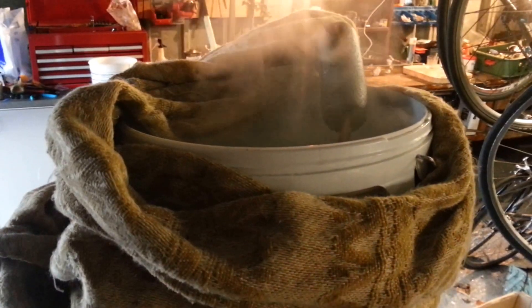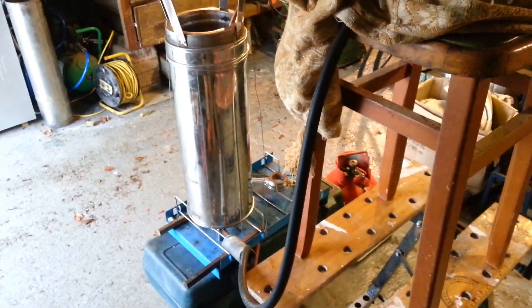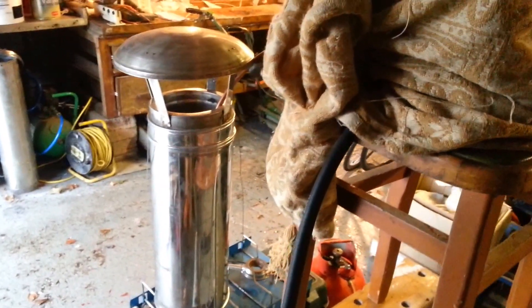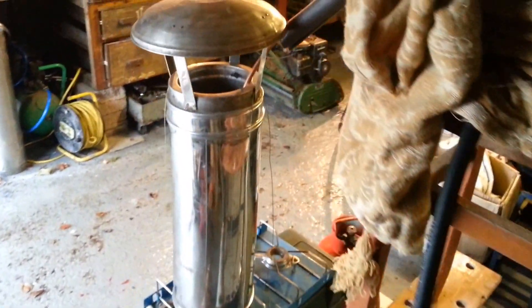That is just a normal plastic bucket — just wrapped the outside in a towel to try and keep some of that heat in there. This could be fitted to any stove, any flue pipe. The burner down the bottom is burning with flue gas going in at 245 degrees, coming out at 172.5 degrees. Creosote formation starts at around 135 degrees, so there's still quite a bit of margin there within safe realms of operating.